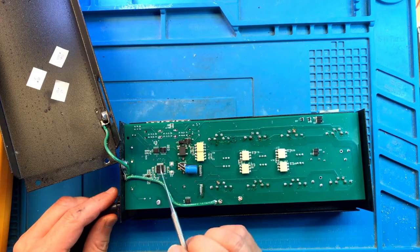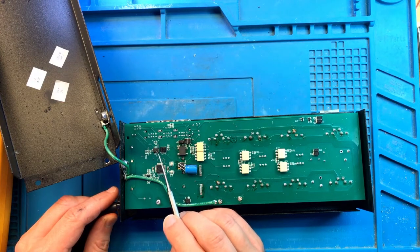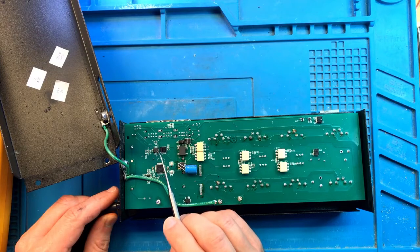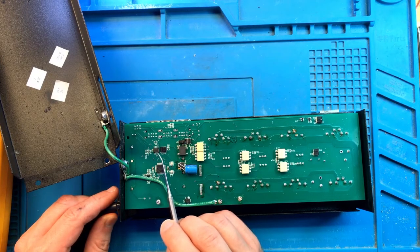Okay, so far on this EB8, we've determined that the CAN transceiver chip is getting very, very hot. It's a common issue, not just with EB8s, but also with EB832s. There are some other videos that I have on EB832 problem with this similar chip. It's a different chip, but the functionality is the same. Go and watch those if you would like. But since this guy is getting hot, likely the problem, we're going to go ahead and replace this chip now and see if this EB8 is going to start working again.